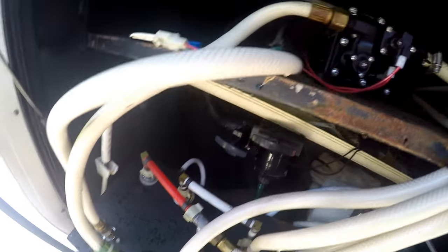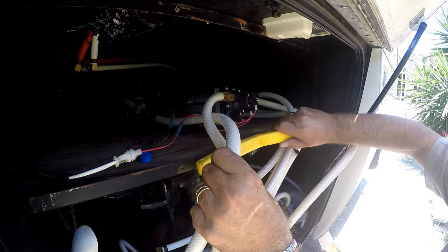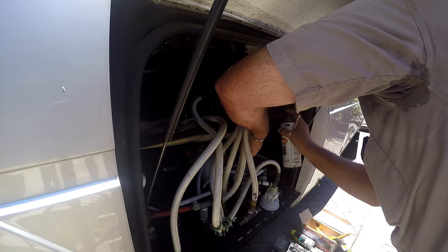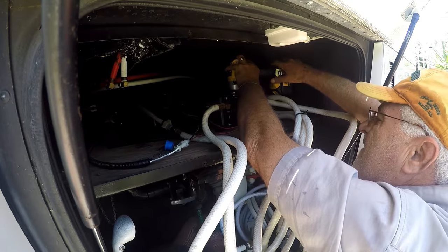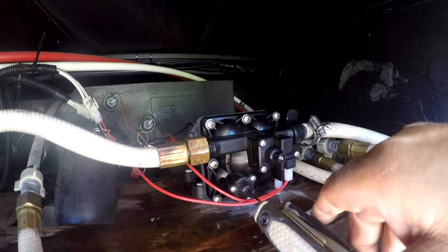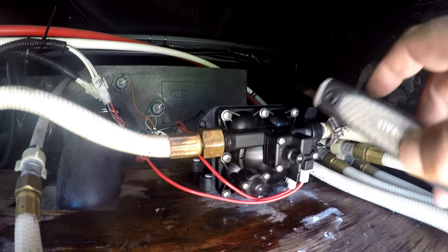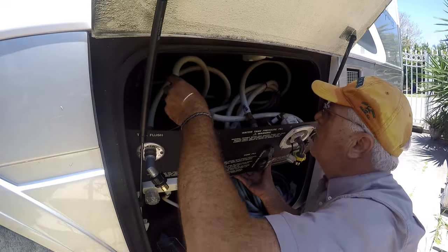I don't like that rust — I'm going to spray it and wait till it dries while I screw the pump on top of the board. I'll use some rust oil. One other important thing to know about this pump is this Allen screw in front of the pressure switch. If you ever hear the pump not shutting off as soon as you close the faucet, just turn this a quarter turn to the right at a time until you hear the pump shut down. A few hours later, everything looked fine and dry including the paint, so I'm putting back the panel.